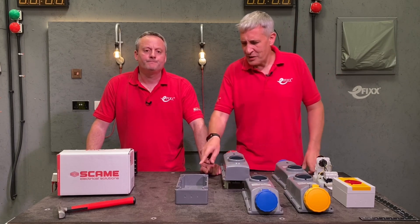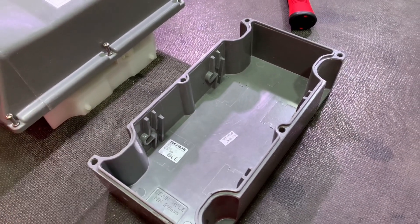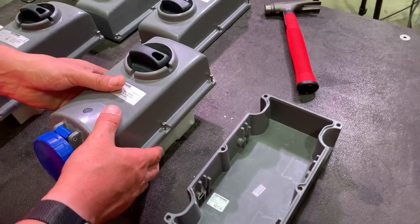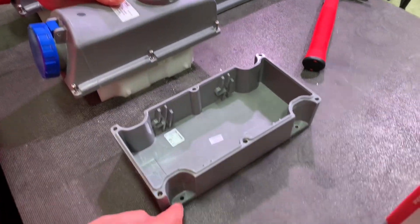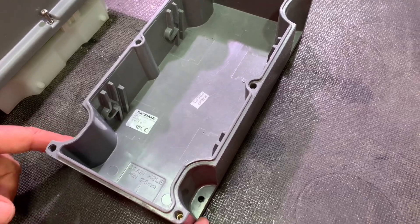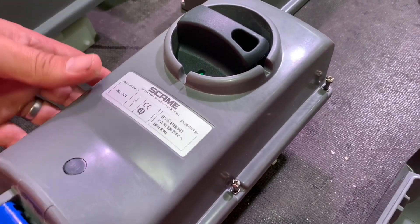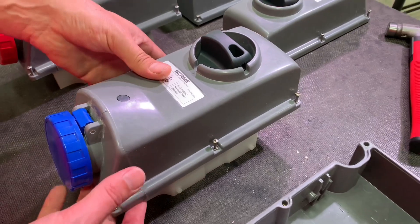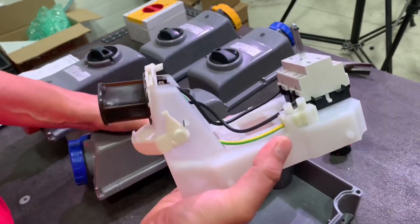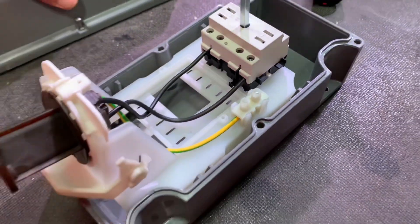Let's have a look at this back box because it's quite clever. The back boxes are bought separately and installed as part of the first fix, but this gives us immense flexibility. You can choose the voltage and current rating later, or change it as the installation goes on. A little feature on the back box: the mounting screws to the surface are external from the IP seal, so you're not having to drill through the enclosure, which helps you maintain that high IP rating. Let's have a look at the front socket — I've got a 230 volt version here. If I flip it over, you'll see it's made up of a number of compartments: here's the socket and the isolator, and that just nests into the housing.